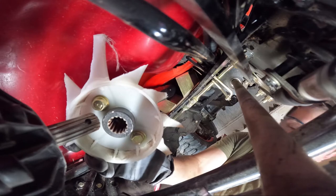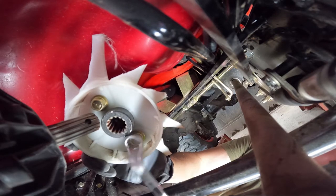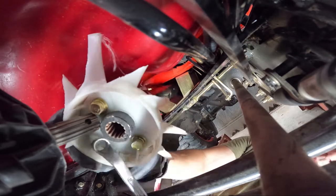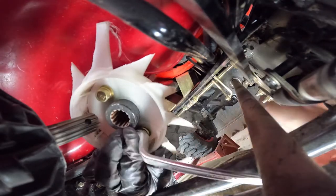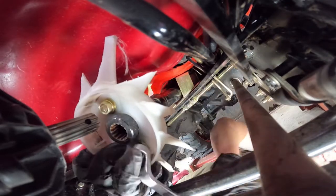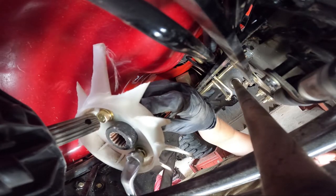Most frustrating part of this video was getting the right angles for you, but this is why you need a 12 millimeter offset to kind of reach around the back side of the fan. But these bolts, they should be relatively protected and very easy to remove. I preferred this method of sticking a finger up there to kind of guide the box end onto the bolt.